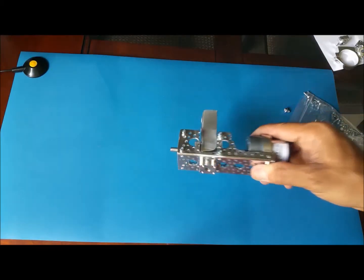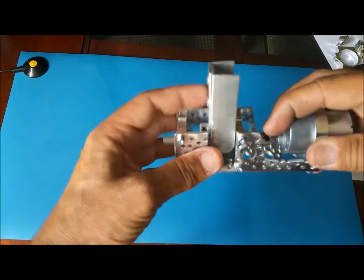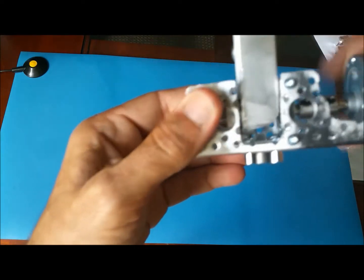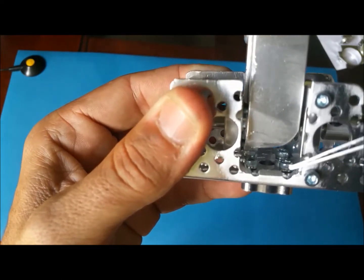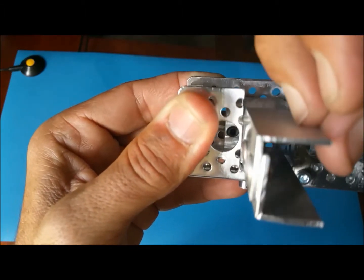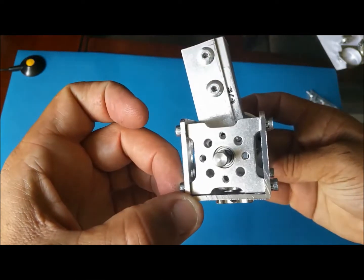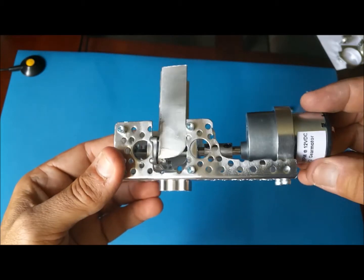I went ahead and installed the coupler, the pillow blocks, and the shaft, and this here is our elevation part. Make sure you have good clearance. That's why we did the grinding here a little bit, to clear those screws that you see in there. Yeah, I think it's looking good. The hub here at the bottom, pillow mount. This would be the elevation portion.